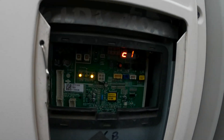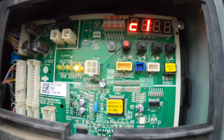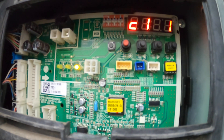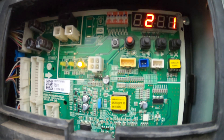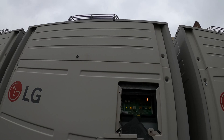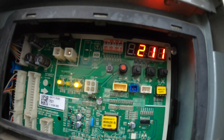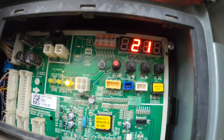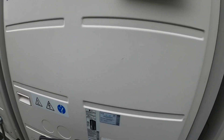And I found we have an error code. If we look closely at this code, we can see C1, 1, and then 211. C1 is compressor 1 and 1 is unit 1 — in this kind of unit we only have one compressor, while other units have multiple. We see a 211, but the error code is actually 21. It's going to be CH21.